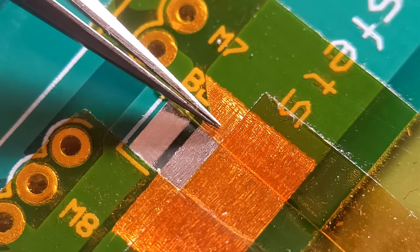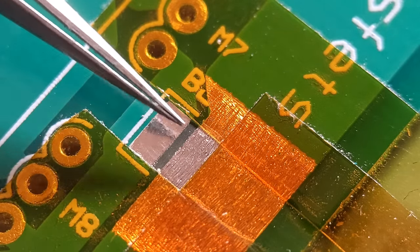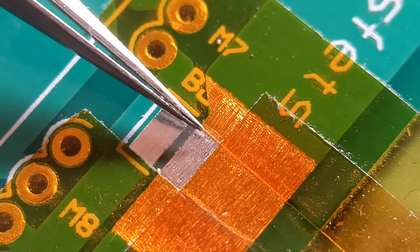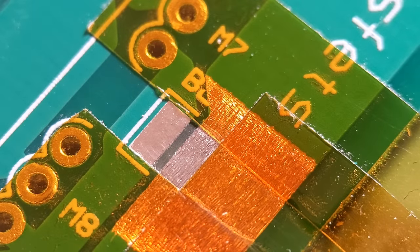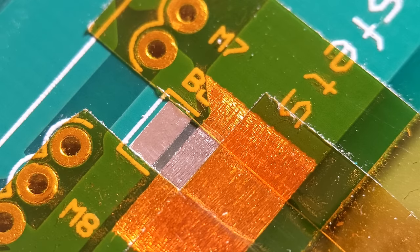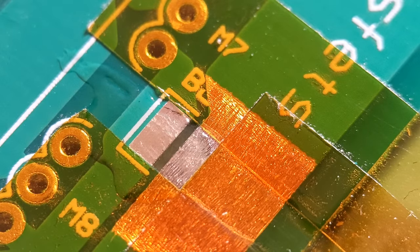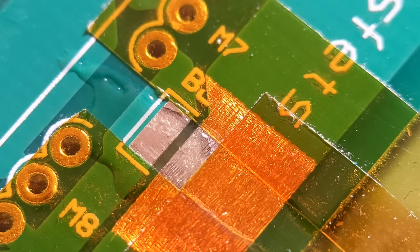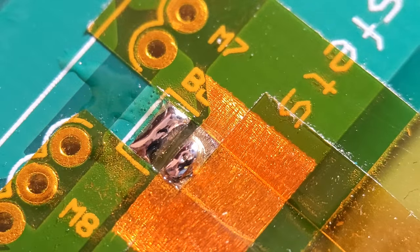You can see I've formed this Kapton border on the unresisted plane where I've scraped it off, basically recreating a similar pad to the one over here. I'm just going to solder both of these up, blob them over, then peel the Kapton off. Hopefully we'll just have a joint going out to this point here without any spread around that area. Just quickly get them soldered up — I'm going to use a larger solder for this. First of all, add some flux as I always do. Just a small amount.